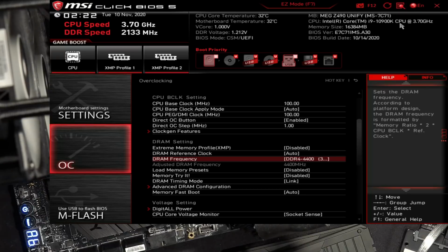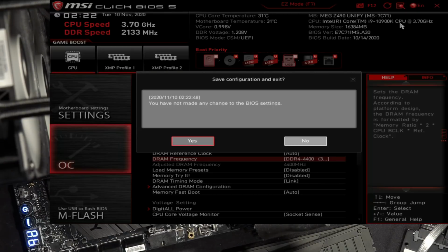So, we're going to do a performance test at 4400 first, because I don't know where this is going to top out. And then we're going to push the DIMMs to even higher frequencies. And I'm using 1.45 volt system agent voltage here, mostly so that we get an extended memory frequency range. At the same time, we're on a 4-DIMM motherboard, which is kind of suboptimal for that.